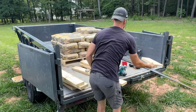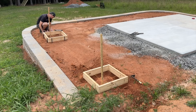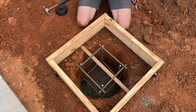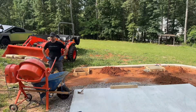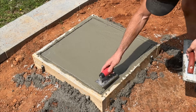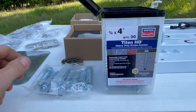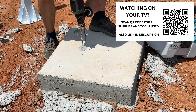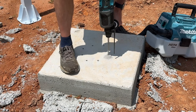The instructions for both the single and dual axis tracker call for a two-foot by two-foot by 27-inch cube of concrete. I made a two-by-two form with two-by-six boards, leveled them up carefully, then used number four (half-inch) rebar to make a cage in the middle of a 16-inch diameter hole. I used nine bags instead of the recommended 14 bags of 80-pound Sakrete, but it makes for a solid base. Position your pole in the middle, mark and drill your holes with a rotary hammer, use Simpson Strong Tie anchors, and make sure to clear out all debris and dust from the holes to prevent anchor failure.